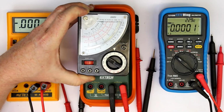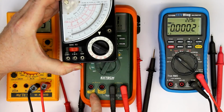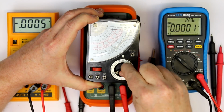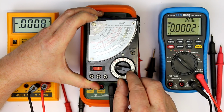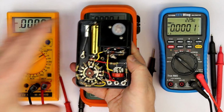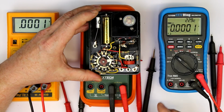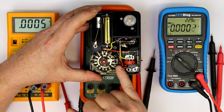First of all, you can see you don't have separate volts, ohms and amps input, just in contrast to the modern multimeters where the amps inputs are always on separate jacks. So that means that by changing the range accidentally from volts to amps, and you have connected this still to a low impedance source, then you have to pray that your multimeter or your circuit survive. And if we take a look inside, there is not a single protection element, no fuse, no MOV, no varistor, nothing. So what will happen is at best your moving coil instrument will survive because this is protected by two diodes.